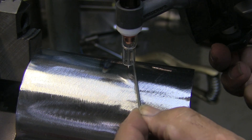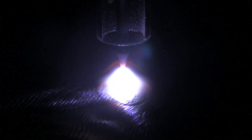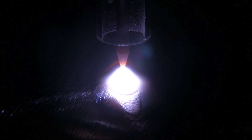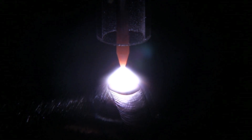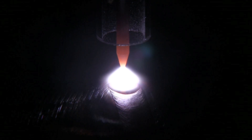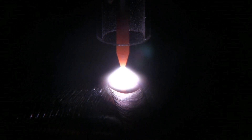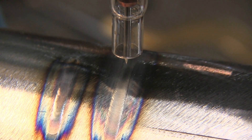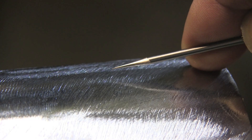Same arc gap. Don't wait around when you start — get things going. I'm going to cut all these the same distance from the start point, just to keep everything the same and not have the results skewed from a different level of preheat or something. That's also a nice stable arc, and the arc cone is a little wider. Nice bead — a little bit better looking overall as far as the ripples and appearance.